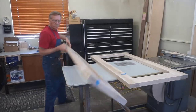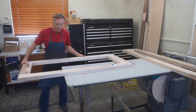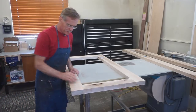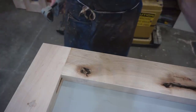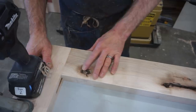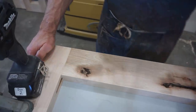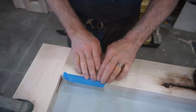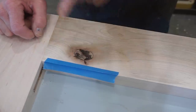I've got all the small repairs prepped and marked, and I like to save the best for last. So I saved this top rail with these pretty significant defects to prep and fill last. I'm beyond busy these days with life and work and I just wish I was faster at shooting and producing videos, because every day in the shop I've got cool stuff going on I want to share. I interrupted my schedule just to shoot this process because it's so useful and effective. This coarse burr is really quick at hogging things out. I'll add a piece of tape on this one as a reminder to preserve this sharp corner.